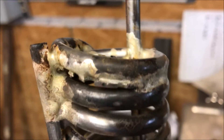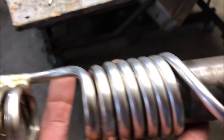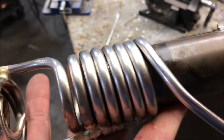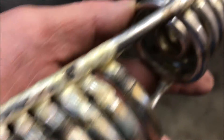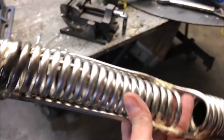This stuff is six dollars a rod, so you're looking at about a twelve-dollar brazing job. The reason I didn't just weld it is because I don't have any argon to back-purge, and with something this thin I still worry about sugaring even with argon. When you get stainless steel so hot it has to be passivated in order to maintain its anti-corrosion abilities. But yeah, there you go — there's twelve dollars worth of braze, and another twenty-five dollars for the guy who did it.